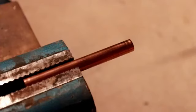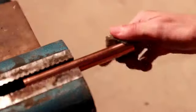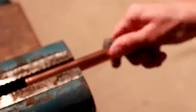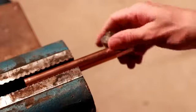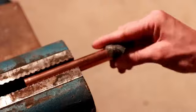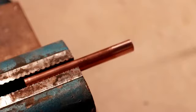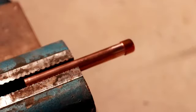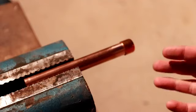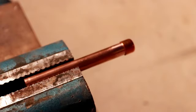So now that I've tested a few things, I'm going to do one more practice run with a confined angle of access to the joint, and I'm going to try that on both sides of this pipe. The whole point here is basically to see if the techniques that I developed with the reach around method for limited access are going to be viable, and if I can make these connections repeatably. Now I'm not going to pressure test this one, I'm just going to visually inspect it. But I do want to see if I can make these connections work effectively without needing to do any further work. I don't want to have to reheat the pipe more than once, basically. I'd like to see if I can do both sides in one fell swoop.